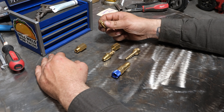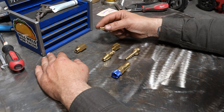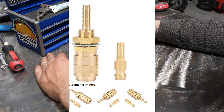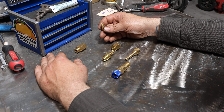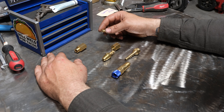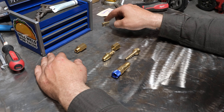Let's start with this little guy first. This is an import or euro style, very common on Everlast machines. I don't have the female adapter handy but I'll put a picture up. These work really well. The downside is it can be hard to find parts — they all look the same but come in different sizes, so finding the right one is a pain. They also use this style for liquid cooling lines on a TIG cooler, though most are only designed for shielding gas, not water.